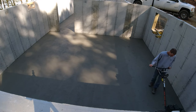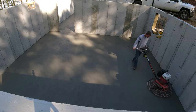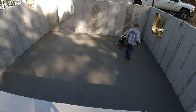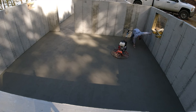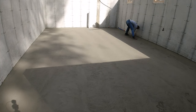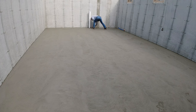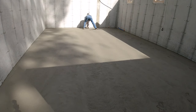My guys tend to like combo blades more now, though when they first started finishing they liked the float blades sliding over the finish blades. I'm getting done with the first hit here, going to jump out, let it sit and cure up a little bit, get a little harder. Then coming back for the second hit, we go around and make sure the edges are really smooth and flat — this is what real finishers do.